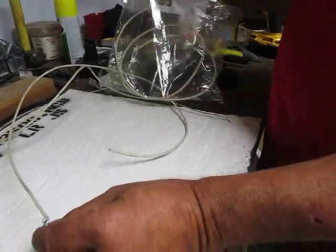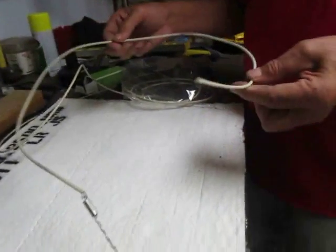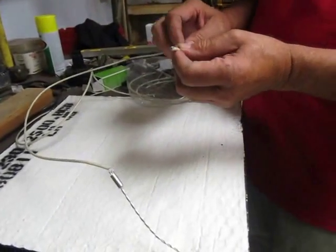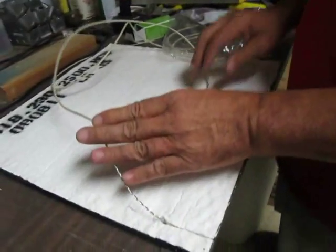What you need to do is reattach that. So you open up your flash dryer and find out that's the problem. The wire should be alright, but if it isn't, you have to get an insulated wire — contact me and I'll tell you, depending on the size of your flash dryer, what gauge wire you need. The bigger the flash dryer, the heavier the wire.